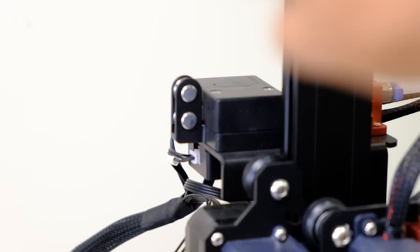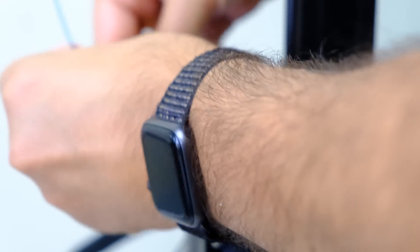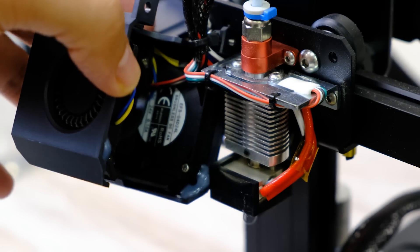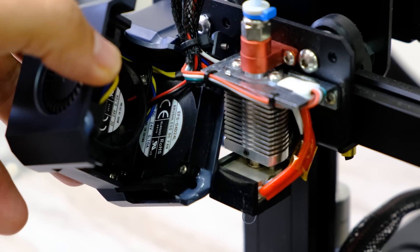Second positive point: the filament end sensor, and this is something I have liked a lot. We have a filament sensor that works great — not only does it detect when we run out of filament, but it also detects if there are tangles, meaning it constantly tracks the movement of the filament. If it detects a tangle or that the filament is blocked, it stops the machine and gives us a message: 'Hey, you have a jam here.' I tried to recreate this on camera several times and couldn't, but there was a time when the machine paused and was telling me about it. For a printer at this price to have a filament sensor that goes a little further is really cool.